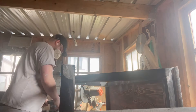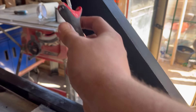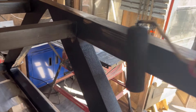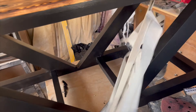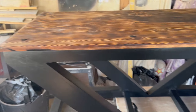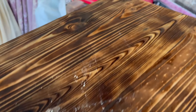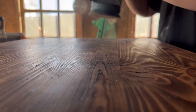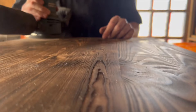It's hard — I haven't had that much experience building these tables yet, so I learn a little bit each time. Here I am using a roller to put on all the base coats. I did go back and use spray paint because it's a more even finish — I just wanted to get the bulk done with the roller paint first because it's a lot harder paint. But the roller doesn't leave as nice a finish as when you spray it. As you can see it's a bit bubbly, and I knew I was going to have to refinish the top anyway. So I went round to all the little holes I missed and filled them in with charcoal and super glue.